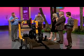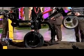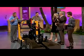The second mechanism that Ross is going to show is a breakout ability. So it actually can automatically break over obstacles in the soil. This is a stump chunk. That's the stump jump. Yep. So that would be done because a log's hit it. It wouldn't be operating it.